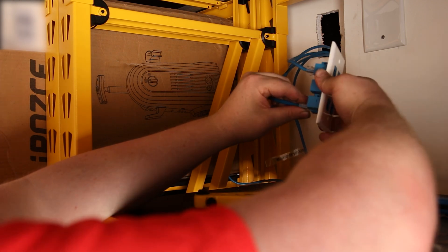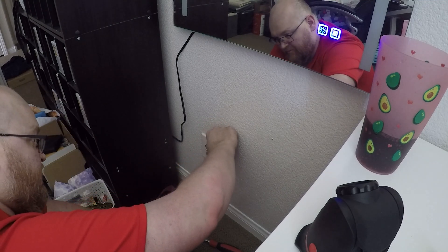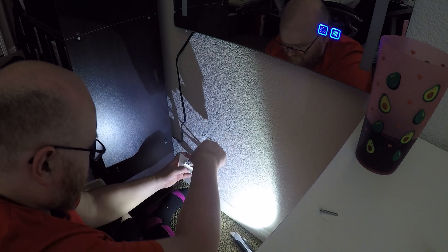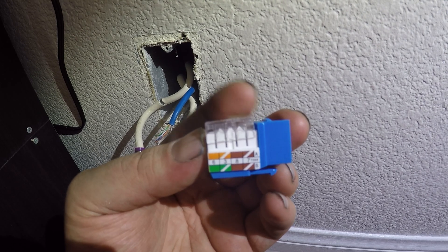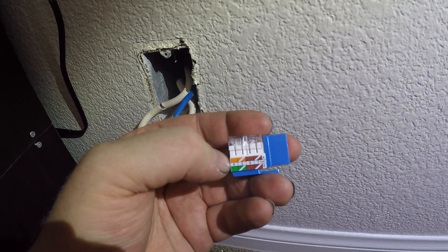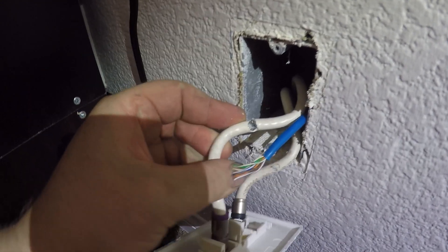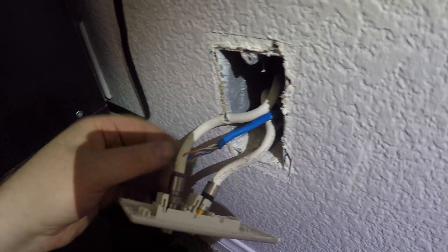I'm hoping it's just the keystone, so I'm going to score it before I do anything. This is the keystone and I'm going to pop it out. You can see it's labeled — if you're using type A on the top, follow those colors; type B on the bottom, use those colors. I'm using type A, so that's brown-white, brown, orange-white, orange, and on this side green-white, green, blue-white, blue. You can see how wrecked this thing is — somebody hacked into it, probably cutting a hole for drywall and just sliced through it. I don't see any damage on the ethernet though, so I got lucky.